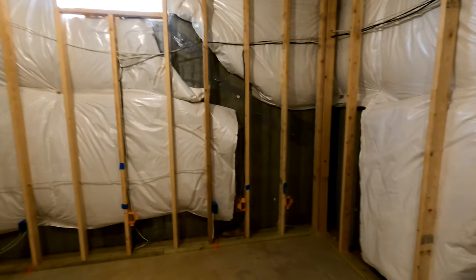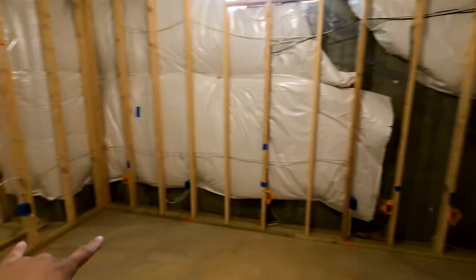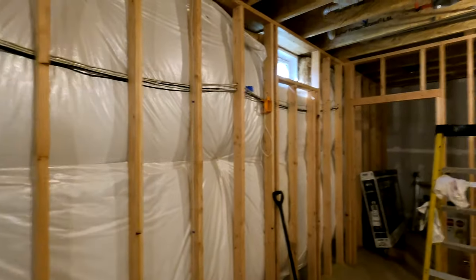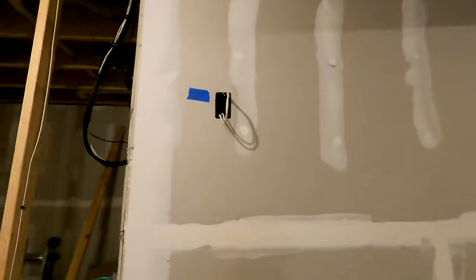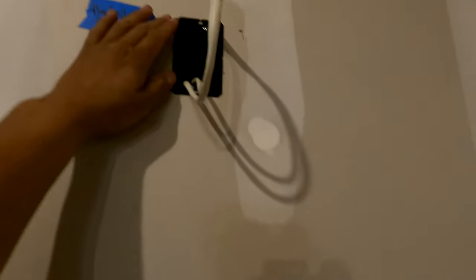On the front screen wall, we ended up with four LV1 orange single gang units, an orange box for the bookshelf, an orange box for the projector, and a wall retrofit box. This pre-wire is completed. The last step — bring the homeowner down, go over everything, debrief to mitigate any oversight, make sure everyone's happy and everything got done to spec. If anything needs correction, we can correct it here and now on site. Also, if you're drilling out studs, make sure you clean up — don't leave the place a mess for other contractors. It's a matter of professionalism. Thanks for watching and we'll see you next time.